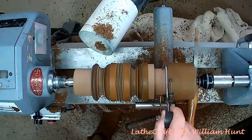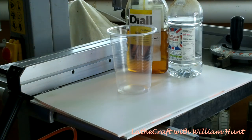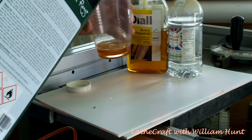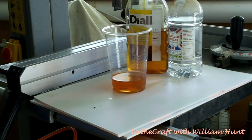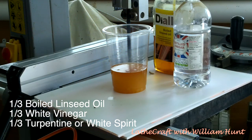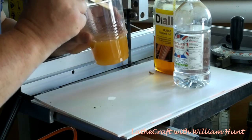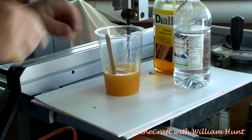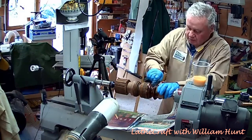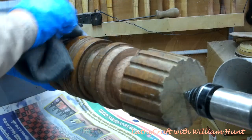So if I don't want to do any sanding, I've got to do some deep cleaning as this is very dusty, dirty and old. I have available to me a family hand-me-down of a very old recipe for a wood cleaning material which cleans off grime, dirt, waxes and polish. This compound is a simple mechanical mix of one third boiled linseed oil, one third turpentine or white spirits, and one third white vinegar. You can apply this cleaning mixture using a variety of techniques, including a cloth, a soft brush, or even a toothbrush — which will help you get in between those flutes and in the corners and cracks where the grime and dirt has accumulated over the years.